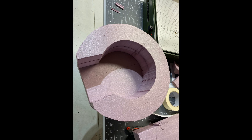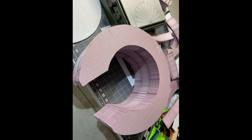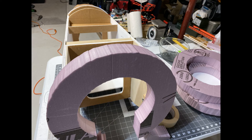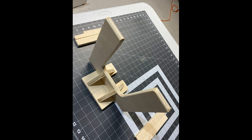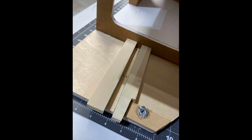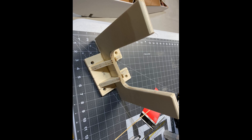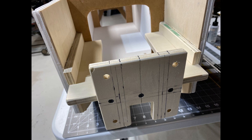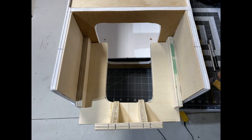Getting the motor system set up and tested, starting to work on the cowling — just three sheets of foam with foam board in front, then sculpted down. Doing a test fit to the firewall using rare earth magnets. Here's the motor mount coming together from metric plywood with down thrust and right thrust built in — it slides in and out. I did permanently glue it in, and you can see why I reinforced the foam board with plywood, because it crushed under the stress of the bolts.